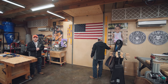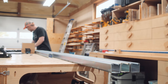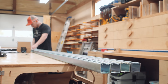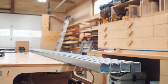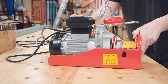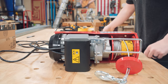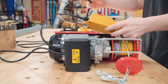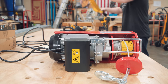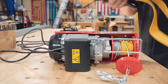Without further ado, let's get started on the build. To guide the elevator up, I'm using four pieces of 1 and 5/8 of an inch super strut. The loft floor is 10 feet off the ground, and to allow the over-travel into the upstairs space, three of these will be used for the two vertical travel locations. The fourth will be used to suspend the hoist. The hoist is a generic hoist that I picked up online, and you can find these electric hoists from various different vendors with various different load capacities. They all look the same, so my guess is that they are manufactured in the same place and branded for different vendors.